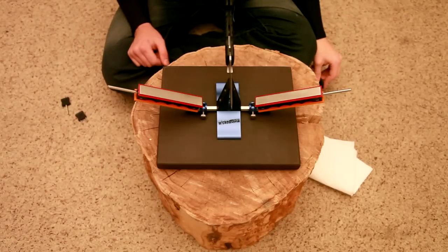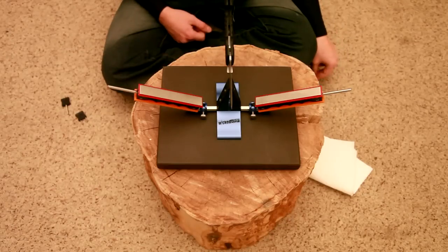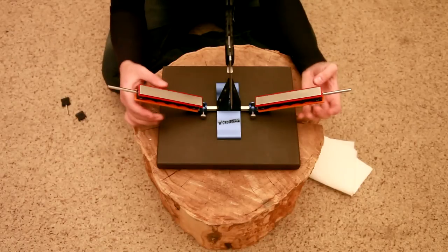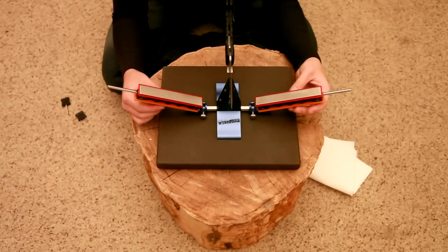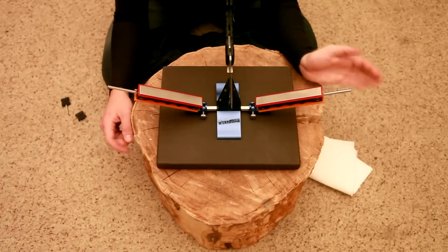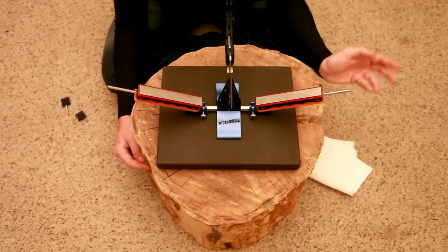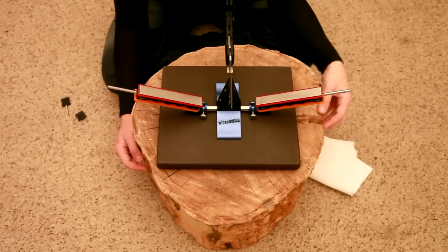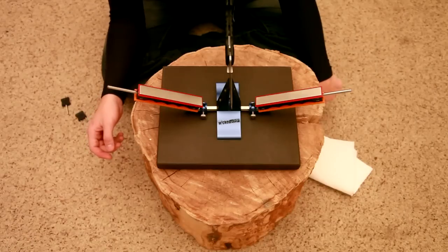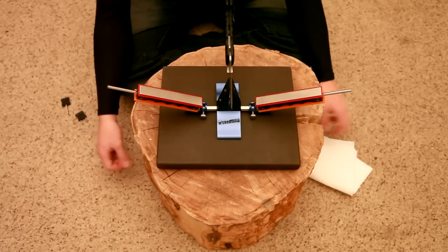I kind of prefer to go more by feel, and then after I feel like we've got it right, we'll throw some Sharpie on the bevel on the blade, and make sure that we're getting all the Sharpie off with each of our passes. Then we'll move on up to the 200 grit stones. Because we've got quite a bit of reprofiling to do, and a lot of it's going to be done with the 100 grits, we'll spare you guys that. We'll turn off for a little bit, then show you with the 200 grits. I'll reprofile till I feel like throwing the Sharpie on, then we'll make sure that we're getting the Sharpie off both sides, and then we'll move up to the 200 grits and up from there and polish the blade till it's hopefully really sharp.